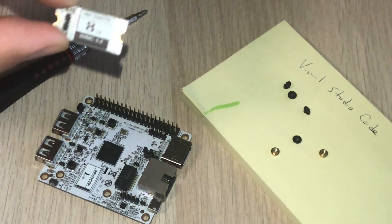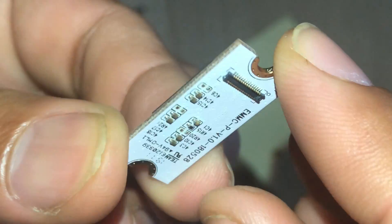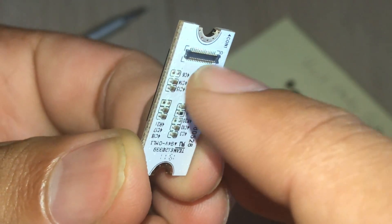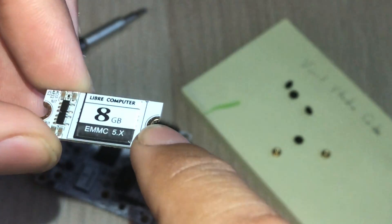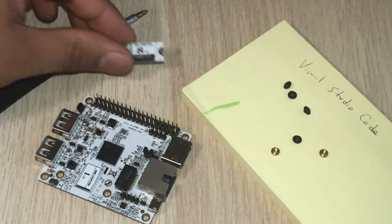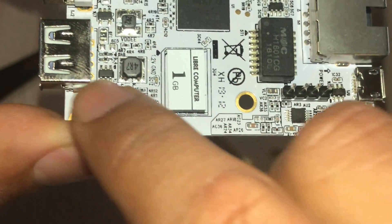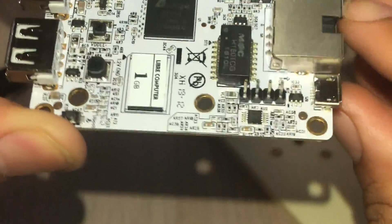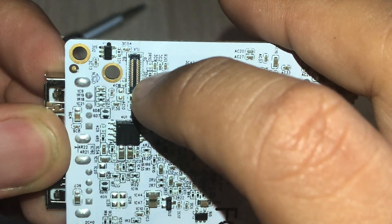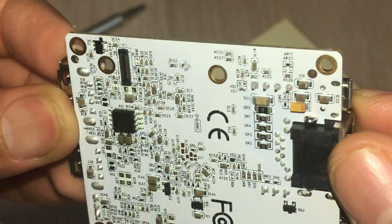We're going to need the module itself. Let me get a close-up here for you guys. I'm using the 8GB eMMC 5.x module. So this is the connector and this will be against the board. It will be held on the board by two screws on both sides of the module. It will go in the board itself. You see these two holes — if we look on the other side of the board, we see a connector. This is the female port of the connector for the eMMC, with holes to hold down the eMMC module.